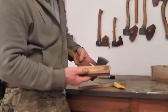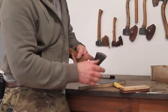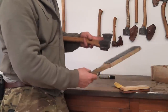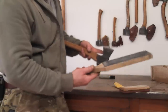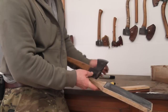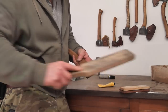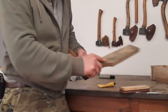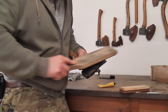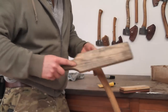So once you've polished both sides of the bevel with the fine stone, you might find that there's still a little bit of burr hanging on, which is difficult to get rid of. So the easiest way to get rid of the burr is to actually use a piece of leather, either stuck to a board or just flat, and then we apply a little bit of Tormek paste, the polishing paste, onto that leather, and then we can strop away from the cutting edge now. Very important that we always go away from the cutting edge, otherwise it's going to just cut the leather. It's not absolutely essential to get it spot on the bevel, because the leather will give ever slightly, and just polish away any burr.